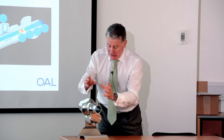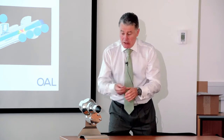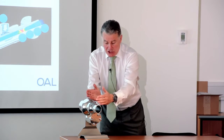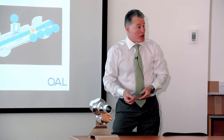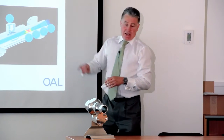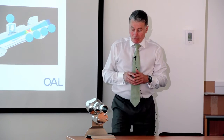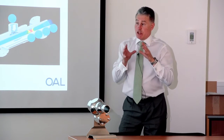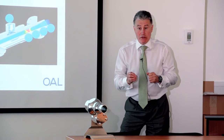The real benefit is the fact that most of the energy transfer is kinetic energy, because you've got that velocity of the steam hitting that fluid. You then get that steam condensing into those droplets, and within that unit you will see that as we go into the mixing chamber we see a negative pressure. As the steam hits and condenses we then start to see an increase in pressure, and we then see a combined fluid flow exiting — that's how the system operates as a pump. You've got very turbulent conditions within that mixing chamber, but those conditions can be tuned to be very turbulent or not so turbulent depending on what we're trying to achieve with the product.